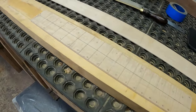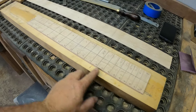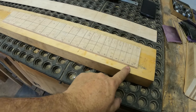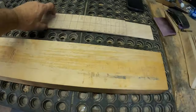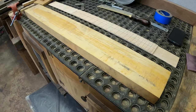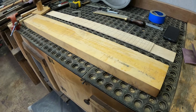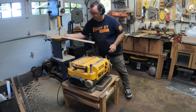With the fretboard laid out, it ends up being — I'm probably going to cut it off at the 20th fret, so it'll only be a 19-fret neck. When you do these conversion necks you aren't really sure how many frets you're going to have until you lay it out and see where everything fits up with the neck pocket. So this is going to be a 19-fret bass. Now it's time to work on the actual neck piece — probably a laminate with some mahogany and some stripes. We're going to rip this thing down to just over three-quarter inch thick for the neck.